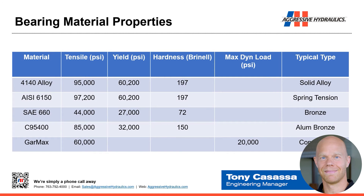Looking across these different materials, here's a comparison chart. Alloy steel has very high strength — tensile strength in the mid-90,000s PSI and yield strength in the 60,000s PSI. 660 bronze is down to 44,000 tensile and 27,000 PSI yield. C954 aluminum bronze sits in between but closer to the steels on tensile at 85,000 PSI, though yield strength at 32,000 is not much higher than 660. The Garamax composite example comes in around 60,000 PSI tensile.